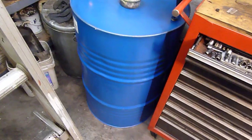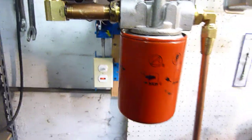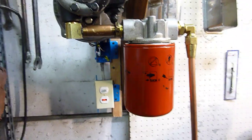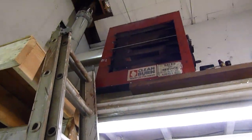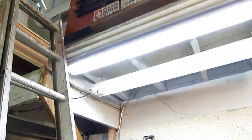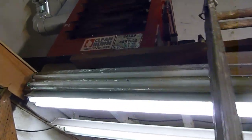I've got my 55-gallon drum mounted here for oil — it's just temporary until I get a 250. I've got a line that runs up here to a filter. I don't know what the micron rating is on this, but they said it would filter out nuts and bolts. Then there's my J pump, and the line runs up to the furnace, which is now working.